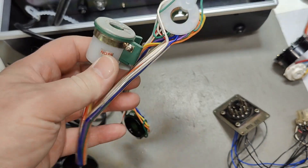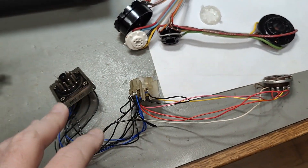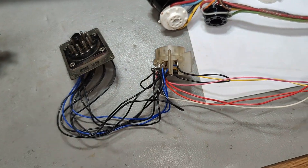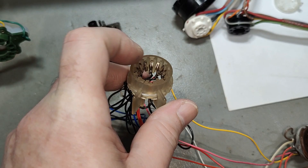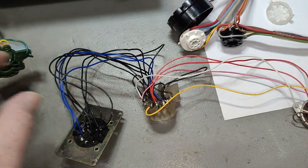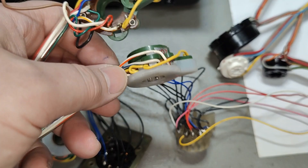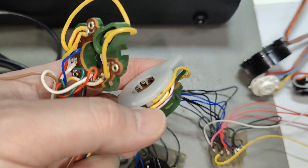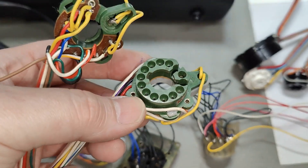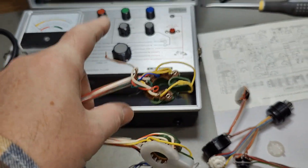I think it supports more or less all the different CRT types. I think this one is more or less homebrew, and this one reads September 1969 and supports some really weird CRT connections. You'll see all the other grids are connected together — grid two and three, brightness, focusing, and so on — and the idea is your beam will have a place to go, so it actually acts as a local anode.